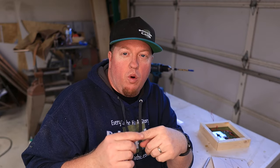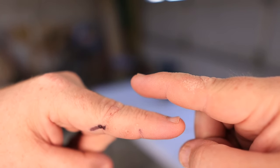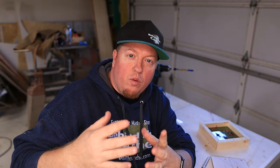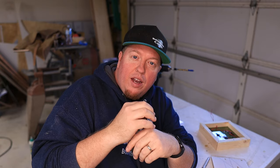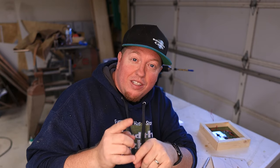The way a reed switch works — these are always open — meaning there are two pieces of metal inside that do not connect. But when you put a magnet to it, it connects and closes that circuit. So you have to get all the puzzle pieces into the right place for all those connections to complete the circuit all the way through. Now I need to mark on the tangram where those magnets are going to go, and then cut it apart.